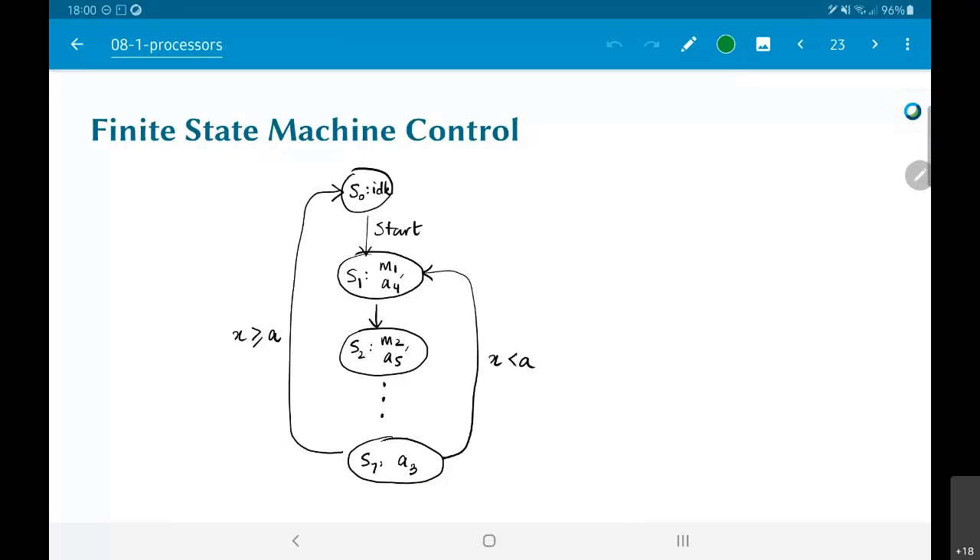One iteration is scheduled in seven clock cycles; between successive calls there is one dead cycle due to going to s0. This is in fact a good representation of how things are done by Vivado HLS. Vivado HLS actually tries to construct these kinds of state machines for most computations. If you dig further into the code we discussed, you'll see it takes the different control steps seen in the analysis view of Vivado HLS and generates one state corresponding to each, coding entry and exit conditions into the Verilog. A large part of the Verilog code generated by Vivado HLS basically corresponds to this control logic.